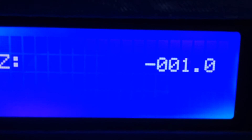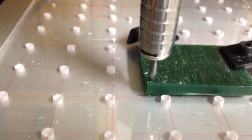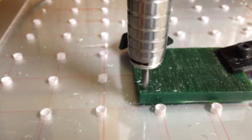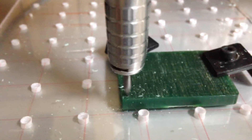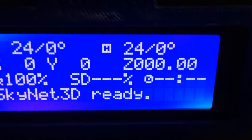I've touched down on the piece, so now I'm going to go down 1.5mm — that's 0.6, 0.7, 0.8, 0.9, 1.0 — I can do this because it's wax. Now that I'm down to the height I'm supposed to be at, I hit the reset button. If you look, it was at negative 1.5 before and now everything is zero. That's the way it should be.